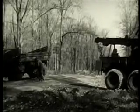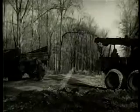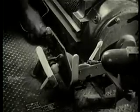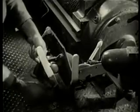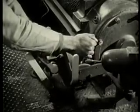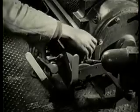Let us review the procedures for operating the rear winch. In the driver's cab, set micro brake lock and shift transfer case to neutral, transmission to 3rd gear, and engage power divider. On the rear of the wrecker, release or apply cable tensioner. Open the clutch air control valve, shift winch control lever to payout position. Open throttle as needed, not to exceed 1,000 RPM.